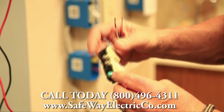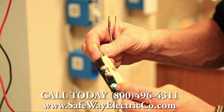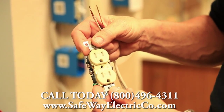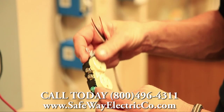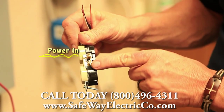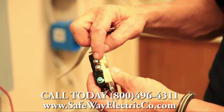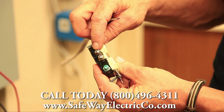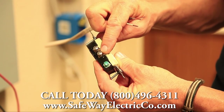You'll notice that these two screws are silver, these two screws are gold, and this screw is green. The green screw is for the ground wire. If you do not have a ground wire on the electrical circuit, you're installing the wrong receptacle — this receptacle requires a ground wire; it will work without it but it's not correct. The gold color screws are for the incoming power; the power comes in and then goes out to the next receptacle on the circuit. The silver screws are for the neutral wires.